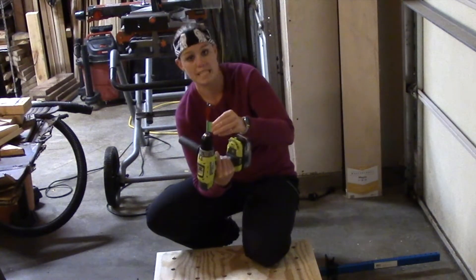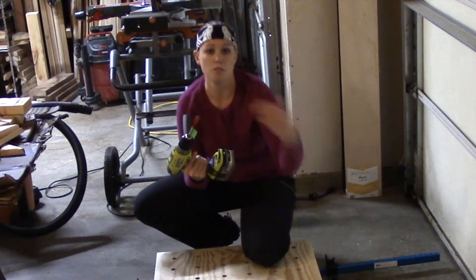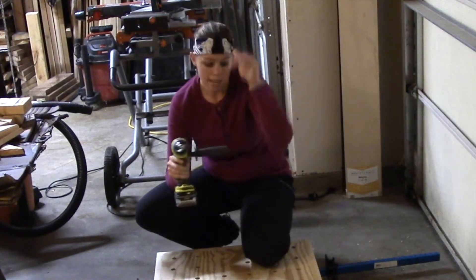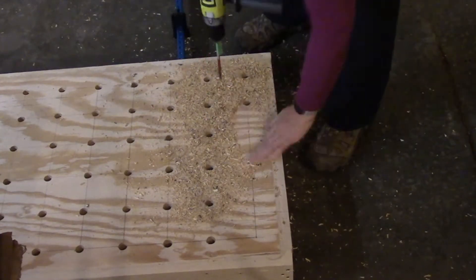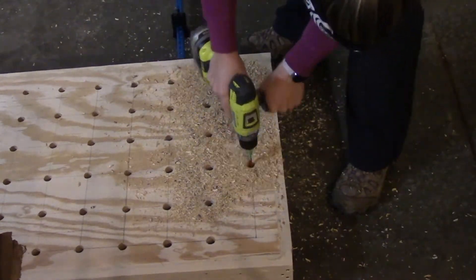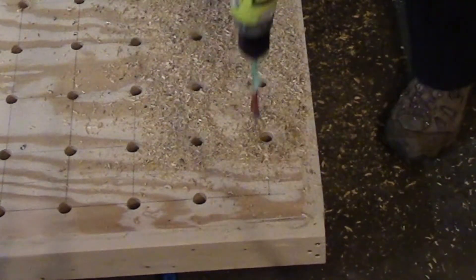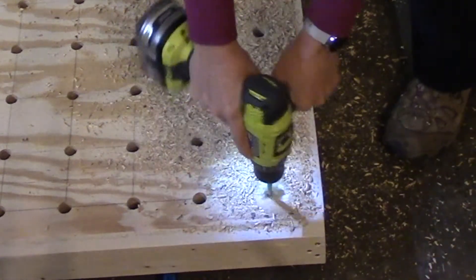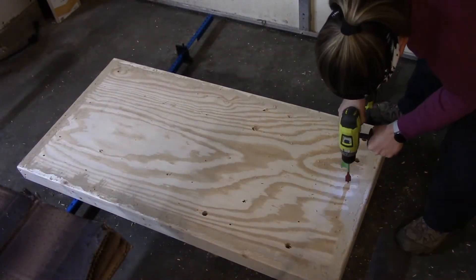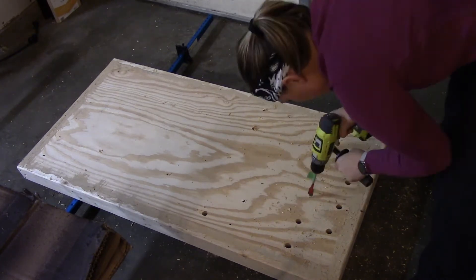I put a little piece of tape at the right depth I need to drill down to — enough to give me a center hole but not to tear out the full opening on the other side. Then when I'm done I'll flip it over, line up this little center point with the hole I drilled, and I'll be straight up and down on these holes. I flipped the workbench over and I'm starting to work from the other side, locating the little holes I made from drilling from the top and now drilling them back down the other way to help reduce tearout.